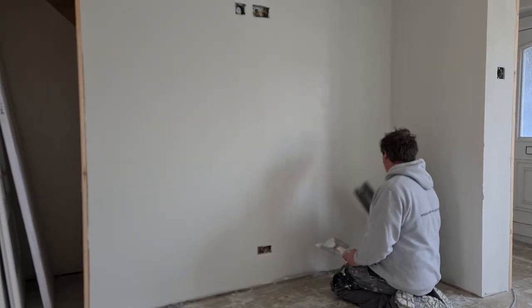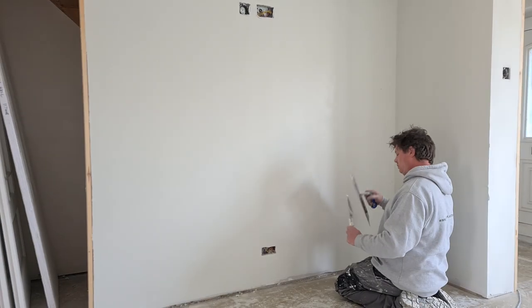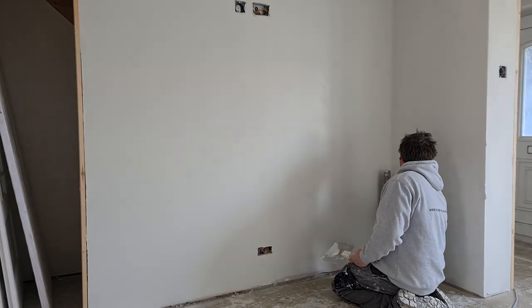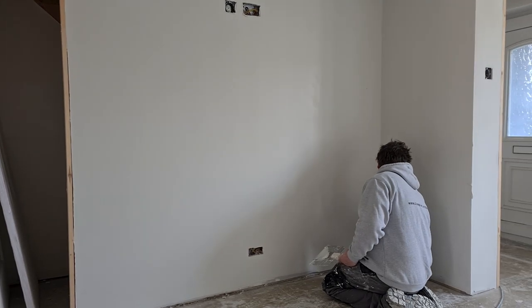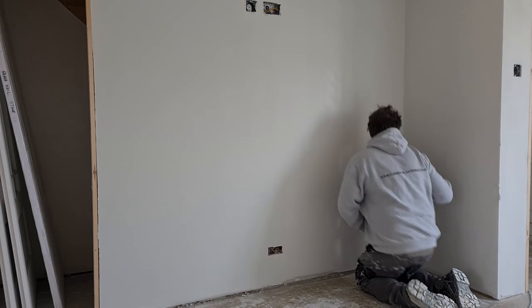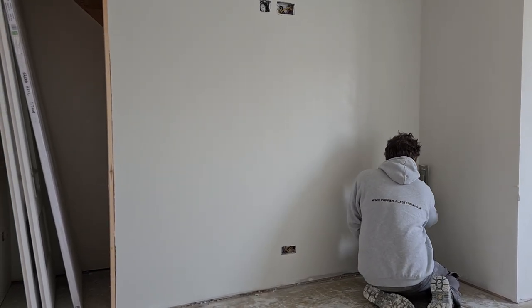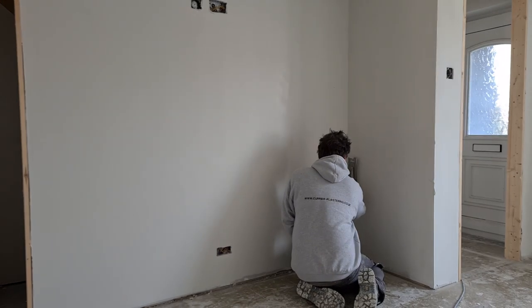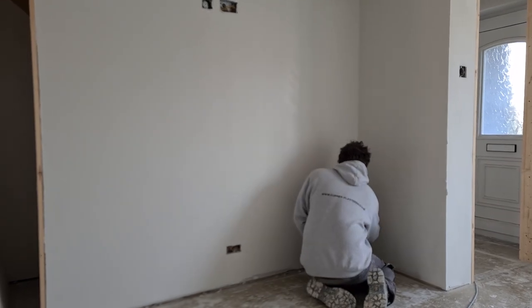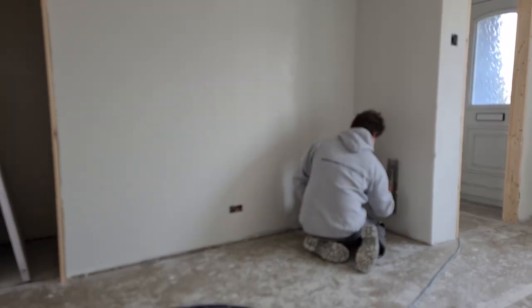How much do we apply for our second coat? That's from Tom South. Hi Tom. Normally we like to think, and we like to spray, that we're about a third of the actual total covering. Most of the thickness, well, two-thirds of the thickness is applied in the first coat. The top coat is just literally a third.